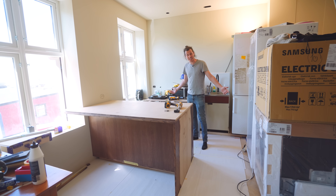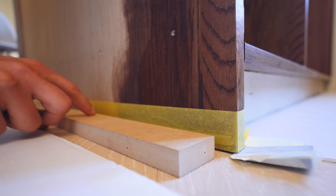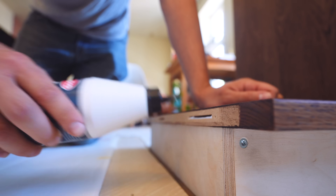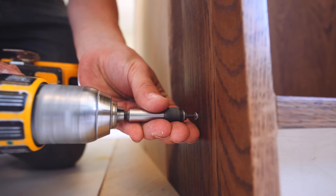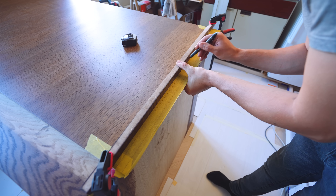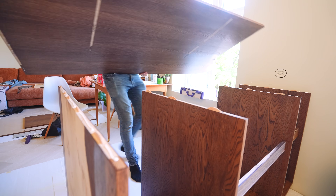This looks like a kitchen island, and for the most part things fit together pretty well. I got both pieces to fit towards the window opening, and I've also installed both the back wall and the side piece. For both of these I left extra length so I could align everything, make sure it was in the right place, and then trim off the excess. For the back wall, since it meets an exterior wall that definitely isn't straight, I pushed it up against the wall, marked the curvature, cut out the piece, reinstalled everything, and it looks fantastic.